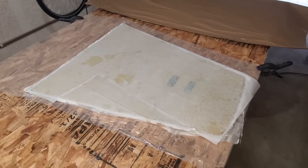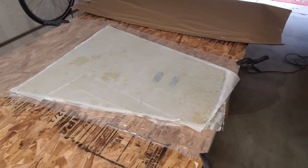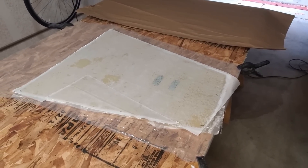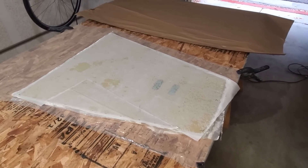The phone ran out of storage space before I could finish that time lapse. But as you can see, I finished putting on the 1708, and now this is the layer of peel ply. I'm going to go ahead and put a piece of plastic over this and then a large plywood board to weigh it down a little, and we'll let that cure.